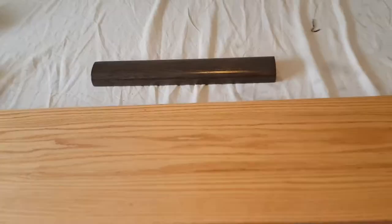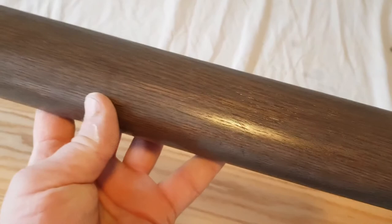This is the finished handrail portion. That does look real nice. And that's what color everything's going to be. Ooh, you can really feel that grain come up after I wet it. I don't know if you can see it, but if I go like this, you can see I'm already pulling the grain off with my bare hand. See that? This was perfectly sanded, but all of that is just coming right off. Once you stain it, it would have been all rough and standing up, and that would have shown up in your clear coat. You don't want that.